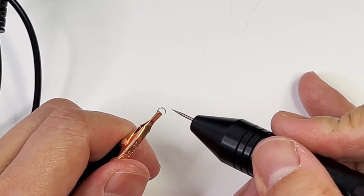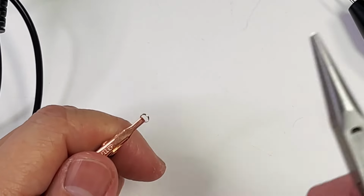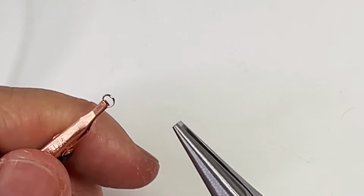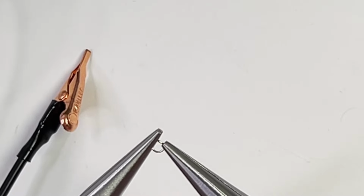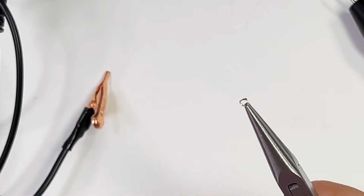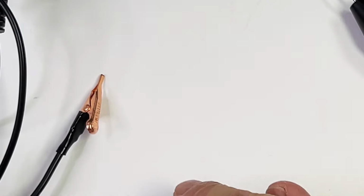Okay, zoomed. Okay, so I think that did it. Now, there is that soot here. That is from oxidation. That's what argon gas would minimize. Okay, so I'm going to see, I twisted it so much and it did not break. That gives you an idea. So 26 gauge, check, very easy.